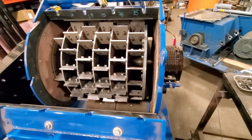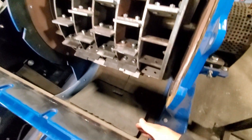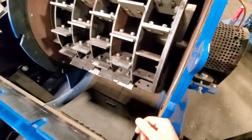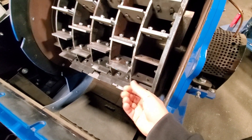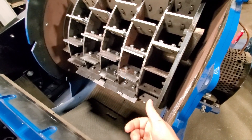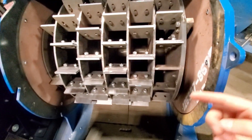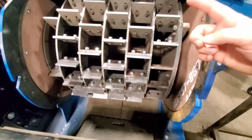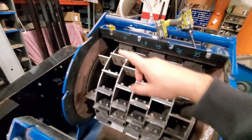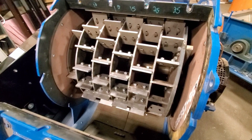The way this cuts is: this blade does not cut against a fixed surface. The area fills up, and then the blade and new incoming material will push the material around, rolling it on itself — kind of like I'm doing with my fingers — but so violently that it just rips the skin right off the copper, and the insulation just pops off. The material moves in a spiral way all the way around and eventually exits through the outlet.